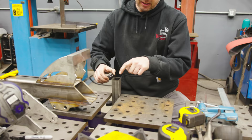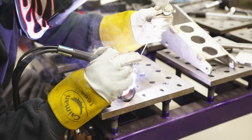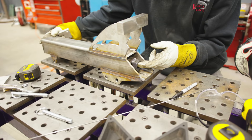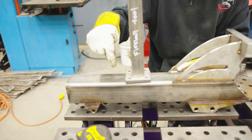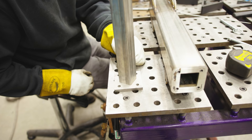This nut is mild steel and the tubing is stainless steel. Can you weld mild steel to stainless? Yes — but you have to use stainless steel wire. If you use mild steel wire on stainless you're gambling. The tube nut slips inside the three-inch tube but it's floating — I need to add a flange on the back and weld the end of that tubing to it. That way the tube nut is serviceable and replaceable. It will also be a nice seal — we can put some silicone around it to prevent moisture from getting in. If this flange isn't welded absolutely perfect it will guide the tube in a weird direction, and the screw won't be able to align properly. I'm fighting distortion and I have to weld this all the way around for strength.